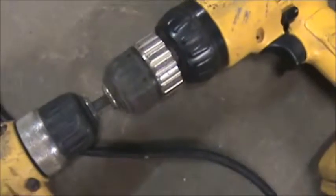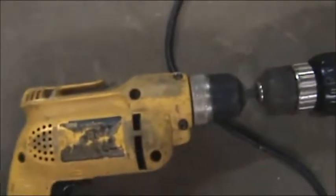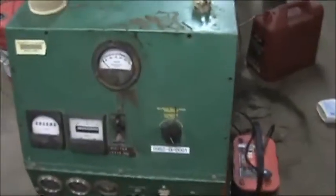We don't really have a standard plug-in — this is a three-phase — but I did hook it up between T3 and the ground, which should be like a 120 or 110 circuit. I hooked up an electric drill, wired up to it just like it would be plugged into a normal generator, with the two drills chucked together with just a stud in between them. I used the cordless drill, cranked it, and it made the other drill spin. That actually acts as a generator and back-fed power into the generator. And now we have a working generator.